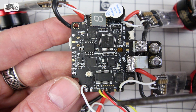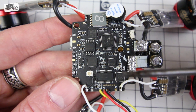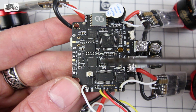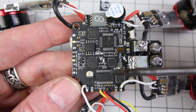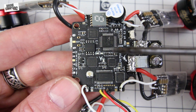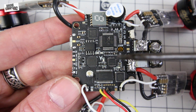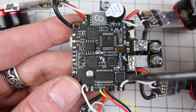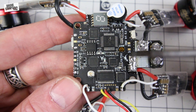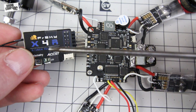One of the things I love most about these all-in-one flight controllers is that I don't have to solder camera wires through to a separate VTX anymore — the VTX is built right in. All I do is solder ground, 5V, and the camera signal wire, and it plugs straight into the camera. That's it. The OSD module is also built in, so no more soldering a separate MinimOSD module onto a bunch of connectors like in the early days. It really simplifies everything.